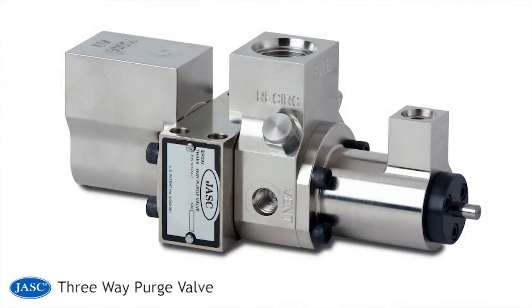In the mid-1990s, after the successful development of the three-way clevis valve servo, we were approached by a gas turbine manufacturer who asked us if we could do something similar for them on a dual fuel gas turbine. We said we certainly thought so. They gave us a specification, we replied to the specification, and they liked the design, so we launched off on the design. It combined the features of the purge air check valve and the features of the liquid fuel check valve into one package with a much more stable design.